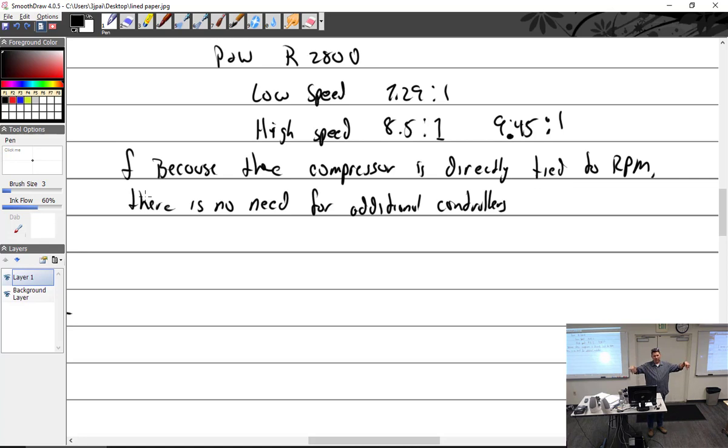The fuel will be injected at the cylinders like always, so it was just air going through the manifold like normal. As he explained to me, if he's in Tahoe or someplace at high altitude, as he increases the throttle he would watch his boost, go pretty much wide open throttle or very close to it, and the boost would be where he wanted it. But when he took off from down here, he could only give it half throttle, and there was enough power that it just leaped off the ground.